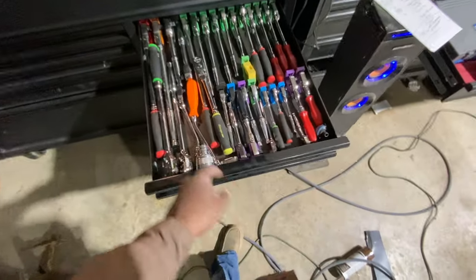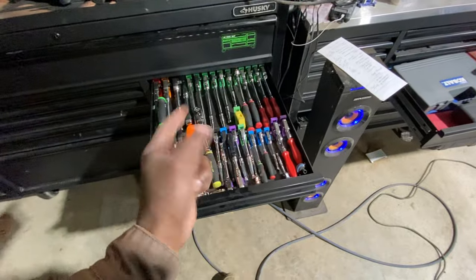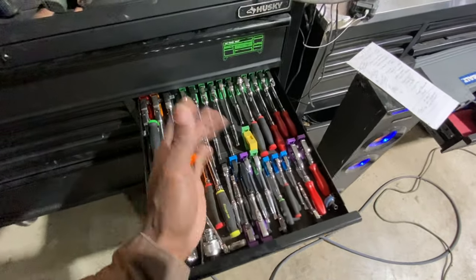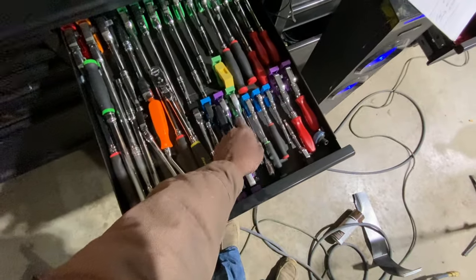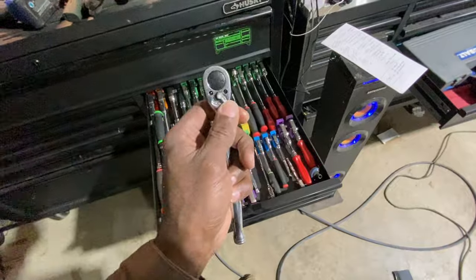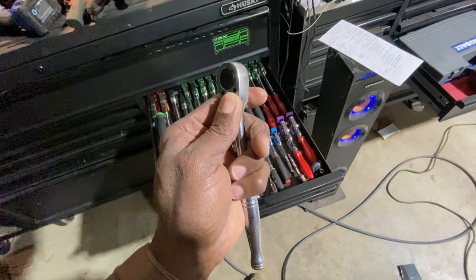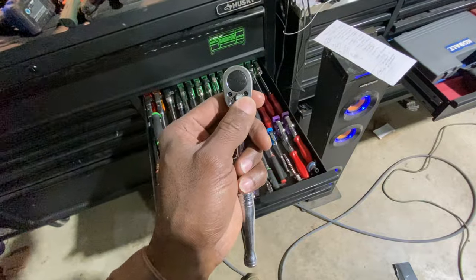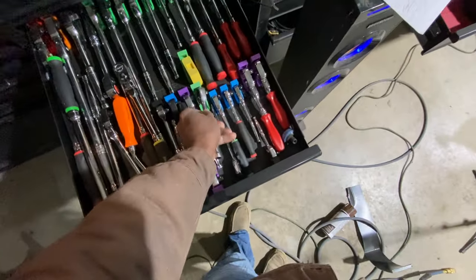Having a lower tooth count typically means you get a larger tooth on both components — the pawl and the gear — and that reduces slipping. I've rebuilt a lot of old ratchets and other things have failed, but the pawl and gear mechanism slipping on each other has rarely been the cause. That's because there's more meat there to bite onto.